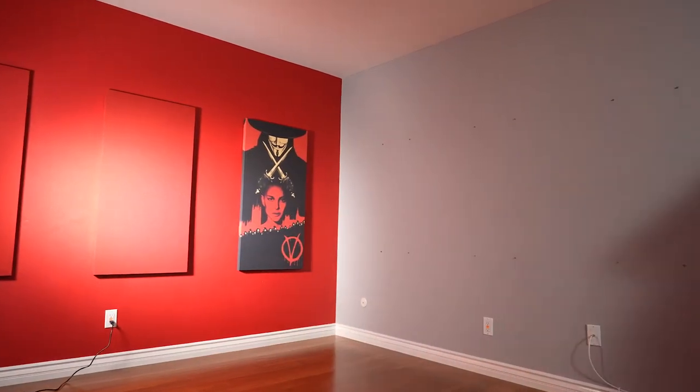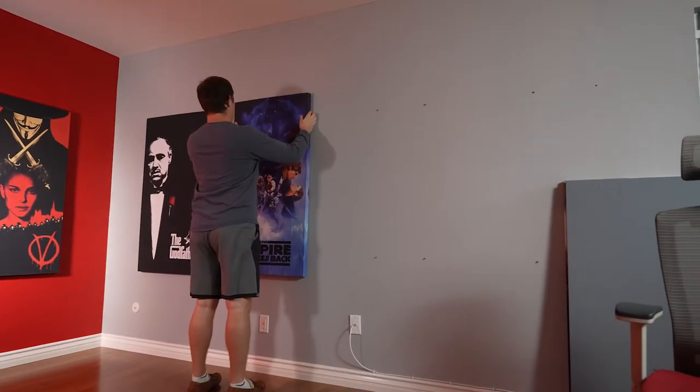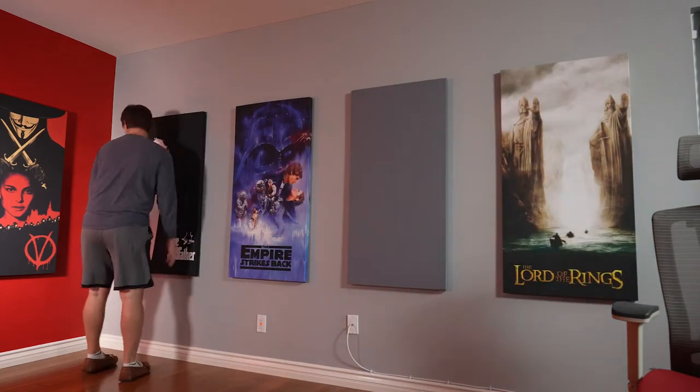I didn't do any tests in this video as we're going to get into some tests here in a second, just to show the steps in the process and what you might need for your situation. For me, the thin acoustic sound panels that you get on Amazon just don't work — not worth the time, not worth the holes you're going to put in your wall. So step one: the first thing you should do is sound panels for the walls. If you talk to an acoustic specialist, they'll tell you about 35% of the walls should be covered with some sort of acoustic treatment — panels, foam, blankets, etc. That's typically going to be in the middle of the wall, and you just divide the square footage of any given wall by three to get to around 33–35%.